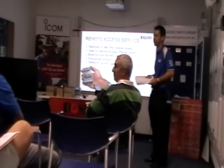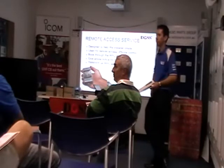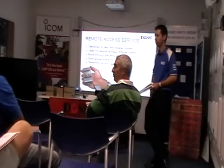But Dyn DNS have actually changed their policies on free things as well. So you need to have your own agreement, and you guys should maybe look at your own DNS domain. Okay, yep. You can own it. That way it's separate. Otherwise you could be hard coding your things, because a lot of them, especially a lot of the routers, are set to one DNS provider, and Dyn DNS changed the way they do it.